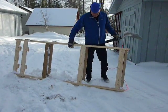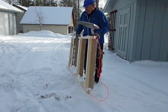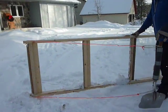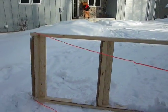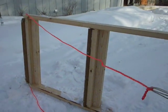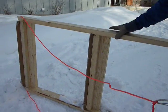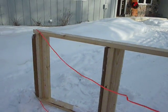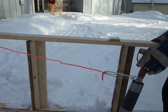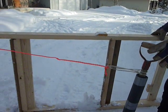The working part of the drag has blades on it, because if you don't have a lot of weight the thing doesn't want to dig in. I put some blades just made out of tempered hardboard at a 30-degree angle, sticking below the rails about a half an inch. This seems to work real well to pick up the snow.